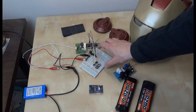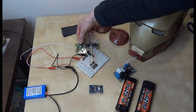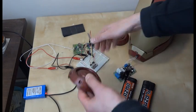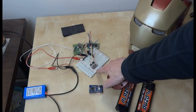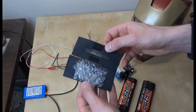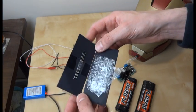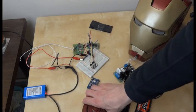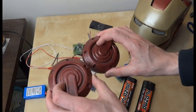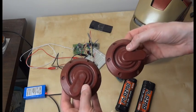We need to fit the transmitter into the suit. These boards are quite small so there's plenty of space for them. We were going to have the two switches for scrolling and select mounted into the hip pods using magnetic reed switches. These are switches that switch when you put a magnet near them. The aim was to have one in each hip pod, and then I would have magnets in the finger of the glove - that means I don't need to have wires going down the arm or anything like that; the whole thing can be mounted in the body.